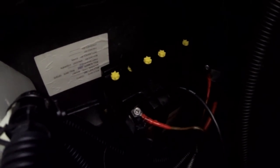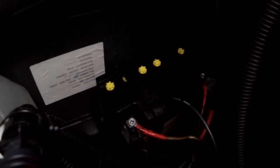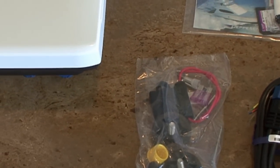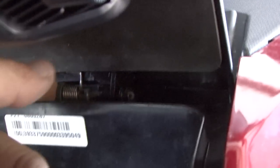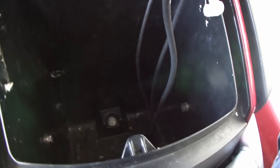Once that's done, while everything's drying, all that's left to do is run the cables up through the hull. We're going to fix the power cable to the battery — put a little terminal on there, screw it down nice and tight. Then run that positive through a fuse and then through a separate switch. That allows us to isolate the unit from the battery so it's not drawing power all the time, even when the unit's off. The fuse which comes in the box is important too, so make sure that's also in the sequence of cable. Run the wires up to the front and make a hole in the bottom of the box for the wires to come up through.